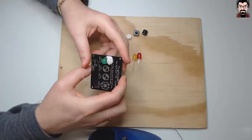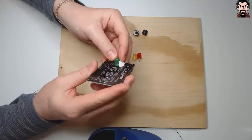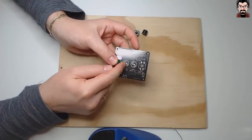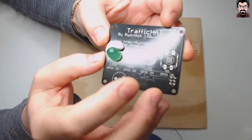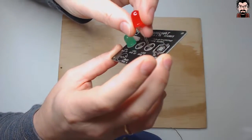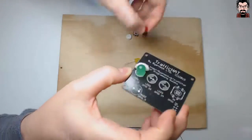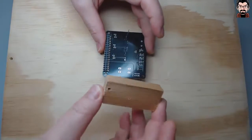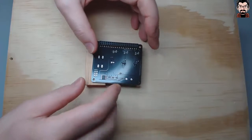As I did in my previous videos, I will use some blue tack to keep the LED firmly in place, and as I explained before, the LEDs will have a flat surface on one side, which is also pictured on the silk screen of the PCB. So follow that direction and put the LED's flat face on the flat part of the design of the silk screen. To help me out in the process, I've used a little piece of wood so that I can keep the PCB flat and leveled to solder the LEDs.